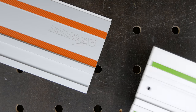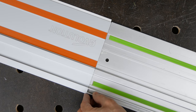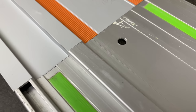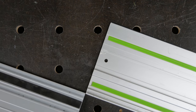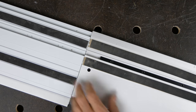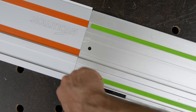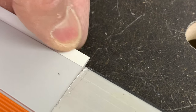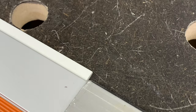Let's take a closer look at the Evolution rails. Evolution caused a bit of a stir when they introduced these, as they do a bundle of two 1400mm rails, clamps, joining bars and a rail bag for less than £70 — pretty incredible value. In terms of size they compare very well to the Festool, with a correct-size rib in the right place and the correct width. They do have a T-slot on the left-hand side of the rail, but it's downward-facing, which means it can't easily be used for accessories. I'm not a fan of the splinter guard — it's a tough white plastic and I prefer the softer dark rubber strip of the Makita rails — but that's a personal preference and they can be changed.